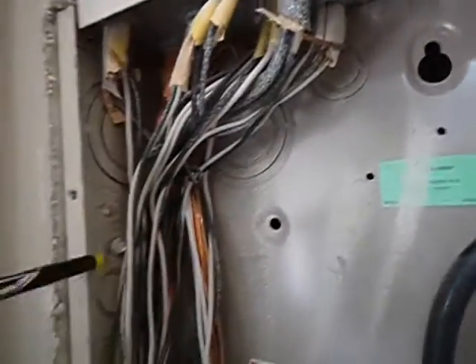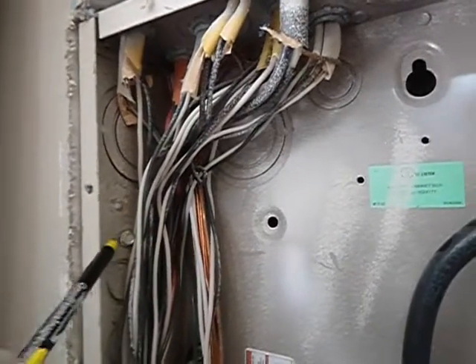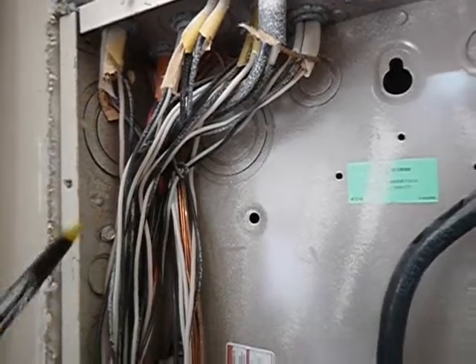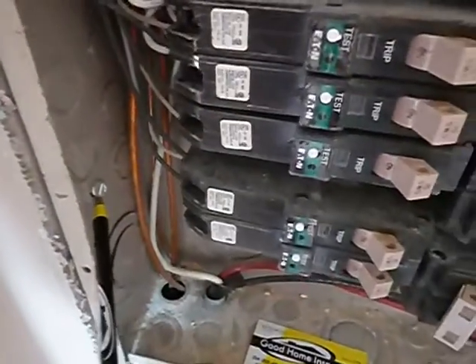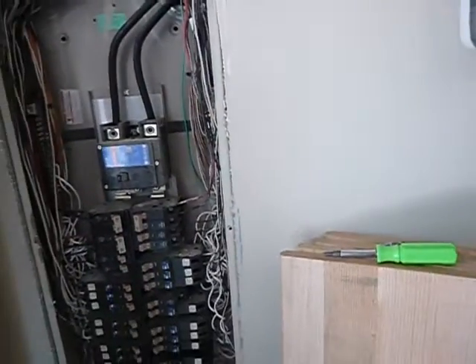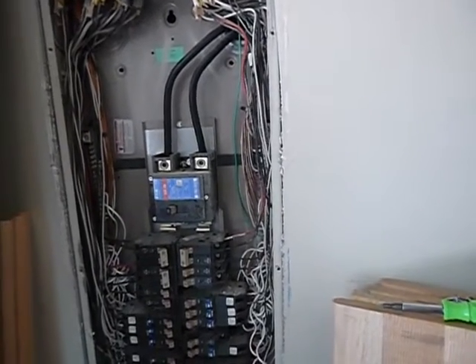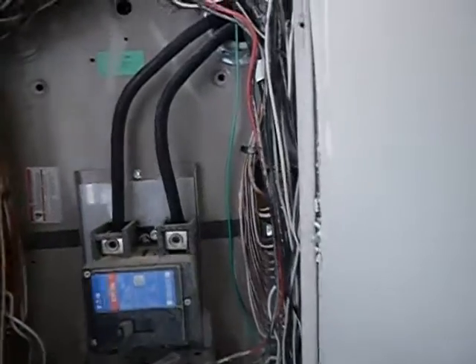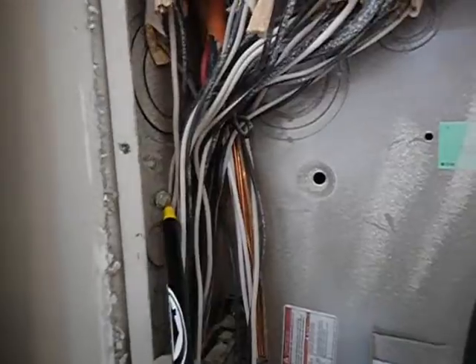What we have here — these are screws. Screws are fast and they're tight, but they do not have the same shear strength as a nail. Nails have more shear strength than screws. So if this structure were to experience a tornado, this panel — this load center — would stand a much better chance of staying in place if it had been nailed in properly instead of screwed in improperly.